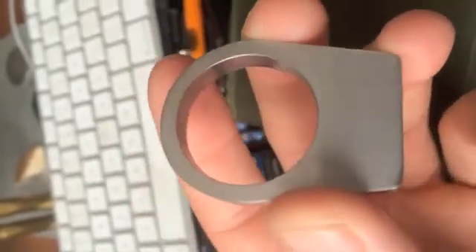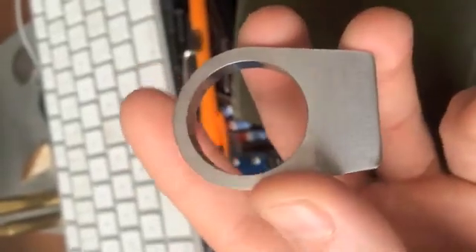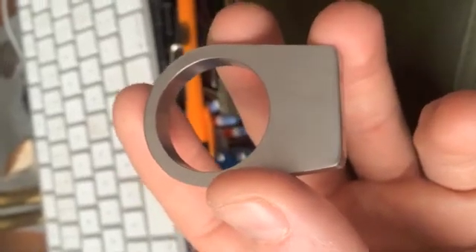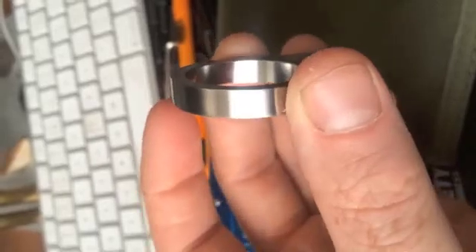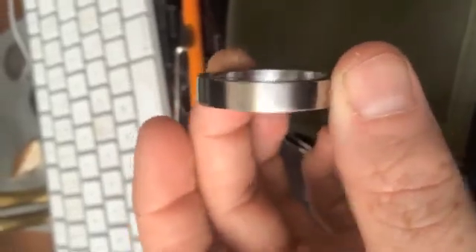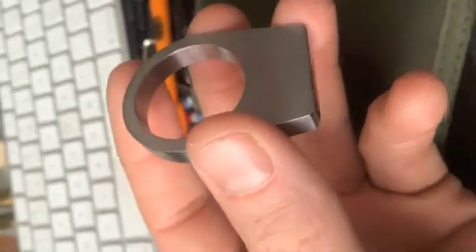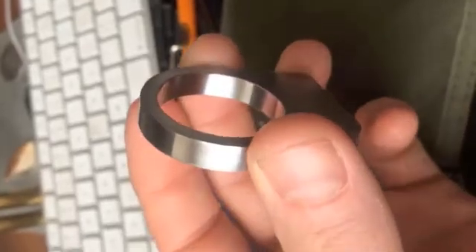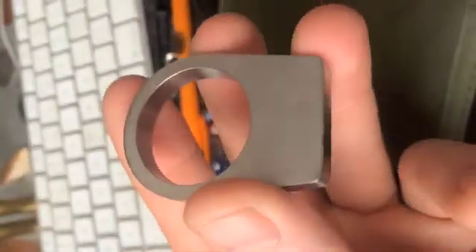But either way, they are surface ground completely flat and finished at whatever number it is. This one's 246 thousandths — right at 246, not 246 and 3 tenths or 5 tenths — so it doesn't put you in a round-up situation when you're calculating headspace.